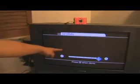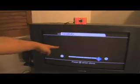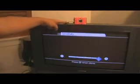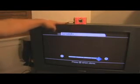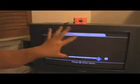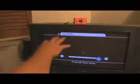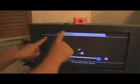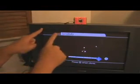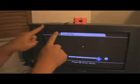Now on the screen down here is a sensitivity adjustment from the Nintendo Wii, and up here you can see that our LED array is powered on. Now the red glow isn't visible to humans, but it's visible to the camera that I'm filming with. Now already you can see that the Nintendo Wii Remote is responding to my hands and to my fingers. Now tracking individual fingers is a little bit tough. There's a lot of extra noise and they have to be pretty close to the Wii Remote. If I pull back far enough, my fingers disappear.